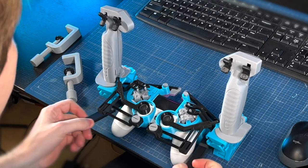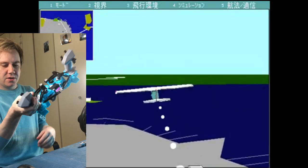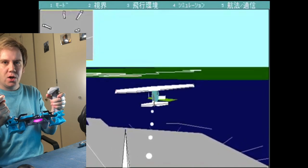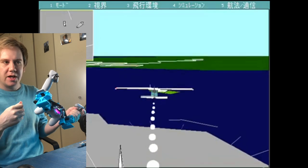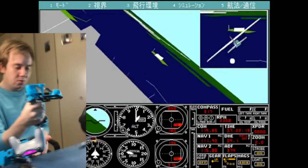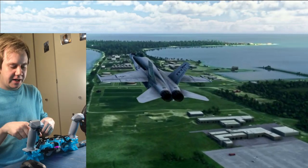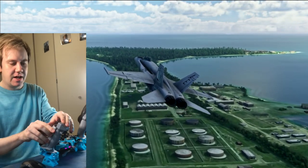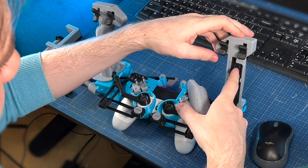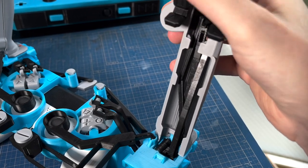With the new improved flexures it's quite sturdy, so you can really abuse it because the flexures themselves never take the full load — especially not in a shear mode. It's always pulling on those filaments. I think the weakest link now would be the linkages that connect the crosses, deltas, and boxes to the face buttons. But I've made these linkages a little bit thicker as well, so they'll be a bit sturdier than before.